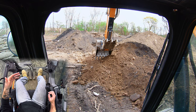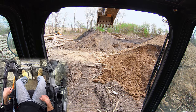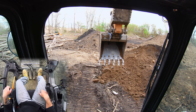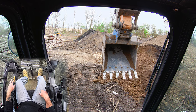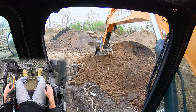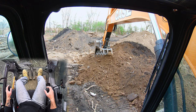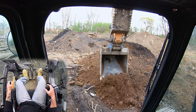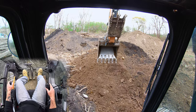As the stick gets closer to 90 degrees, you start out having to boom up fairly fast, but the closer you get to 90 degrees it slows down — it kind of levels out for a second at 90 degrees, then starts to come back up toward the machine. So we have to match that arc with our boom. In the beginning I'm pulling back a good amount of boom, but as I get closer to that 90-degree mark I ease back to neutral because I don't need to boom up as fast.